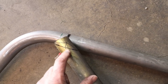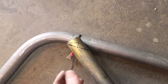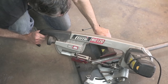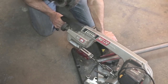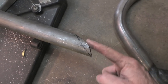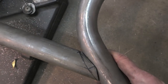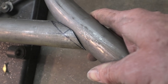I also put a centerline on the tube so when I put this in the saw I have that line pointing straight up — it doesn't rotate in the saw, and when I'm cutting through the entire tube the backside will be just as good as the front side. After cutting across those two hand-drawn lines — one cut here and one cut here — you can see without doing any additional work the gaps are pretty good. With a MIG welder you could just weld this as is, but I'm going to finesse it a little bit on the inside.